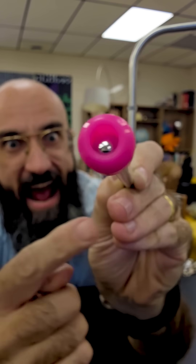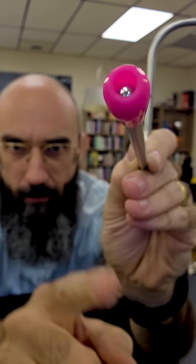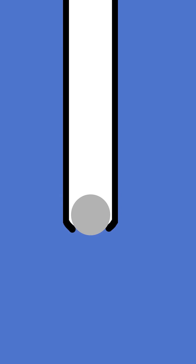Here's how it works. At the bottom of the straw, there's a mechanical pump that consists of a ball that can jiggle back and forth but not fall out of the hole. When shaken, on the downstroke, the straw rushes ahead of the ball and liquid comes in. On the upstroke, the ball slaps into the straw and seals it closed.